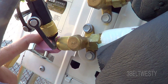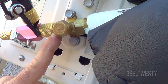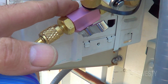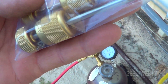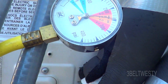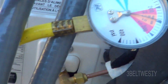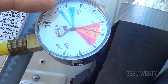This is a 5/16 inch valve core remover. This is a quarter inch — I've removed the valve core here from the mini split, and I've also removed the valve core of the pink 5/16ths side port. So those two are right down in here. And then I've got a pressure gauge here — this is one from the dark ages, JC Whitney. This is a shutoff here so it doesn't leak through the gauge over time.